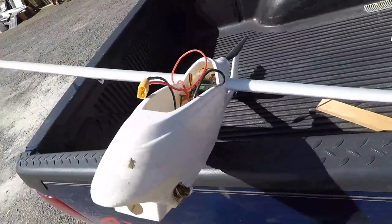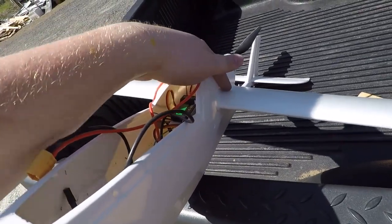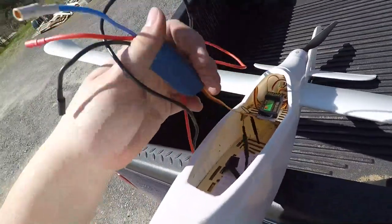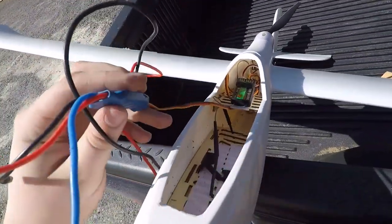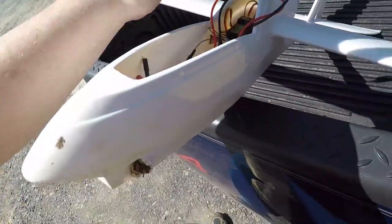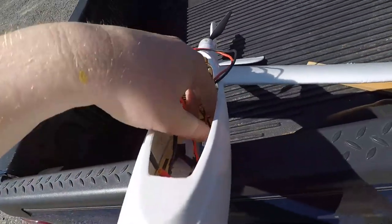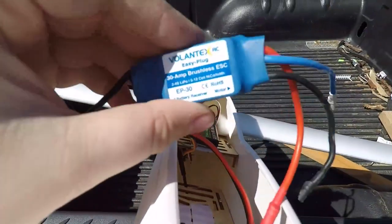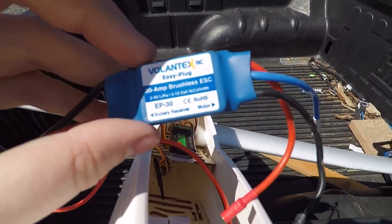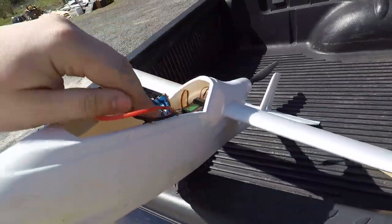Back here at the house — I couldn't get the plane ready to fly yet. I got the rod bent a little bit more but it's not quite enough to let the wings connect in, so I have to straighten that out more. I also noticed the whole ESC had come out, disconnecting the cables from the motor, and there's dirt down in there. So I want to completely tear this all down, take the body apart, make sure all the cabling is okay, and fasten that ESC better. It looks like it has a Volantex Easy Plug 30-amp brushless ESC, and it is rated for 4S.